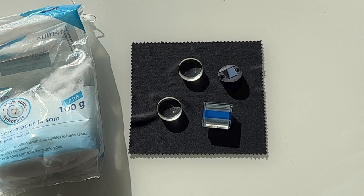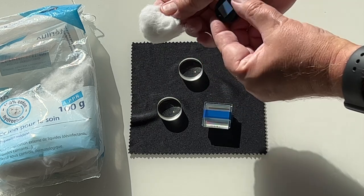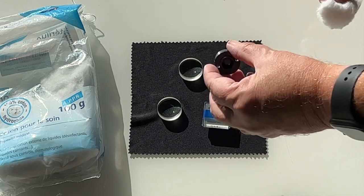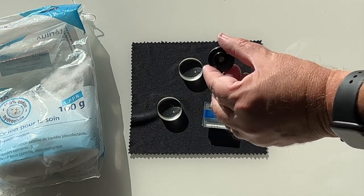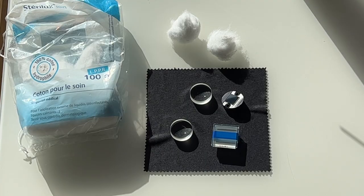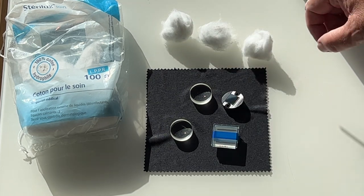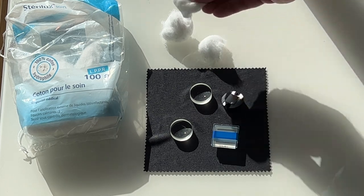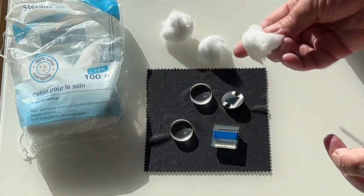The surfaces are reasonably robust. You can also clean the slit in the same way, but only the side with the large surface — always with cotton to remove fingerprints or dust. On the other hand, the opposite side visible through the hole is not accessible; you never touch it, as you would do more damage than good. The great secret of optical cleaning is to change the cotton often when working on a surface, which will effectively remove traces of grease. Avoid putting your fingers on the part of the cotton that will be in contact with the glass.